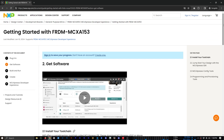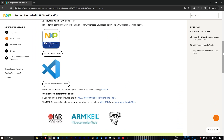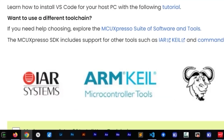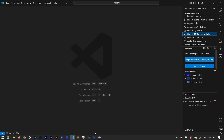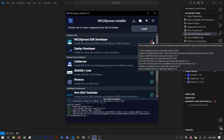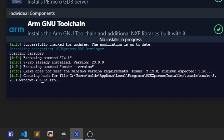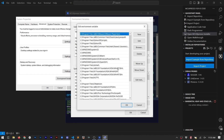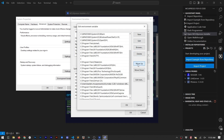These processors are supported by NXP's MCUXpresso SDK. There is a standalone version, extensions for VS Code, and support for other third-party microcontroller IDEs. I like using VS Code because I use it for everything now. But I did run into a couple of issues. The VS Code extension relies on an installer for the necessary dependencies. While it works well, it will get upset if you have any of the tools it installs already available in your path. For example, I kept getting errors about the wrong CMake version being installed. If you run into this, either install the correct version at once, remove CMake from your path, or give its version priority in your path.